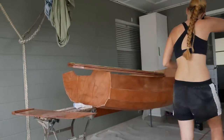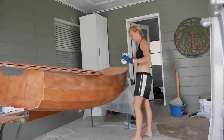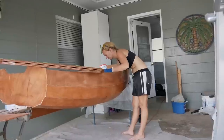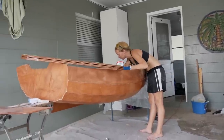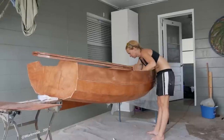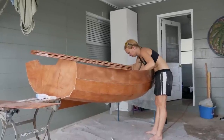You wanted to put it on the boat. I think you should put it on the boat to start with, along the bottom line, between the tapes. But don't go up the sides too far. Go up like, but don't go where it's vertical. Yeah. And then we put it on the piece where it's vertical. Okay. And really, we're happy if we get a spot weld at this point. Okay. If it locks in, and then we fill it in. And what we don't get on the inside, don't sweat, because when we cut it in half, we get access to that. True.